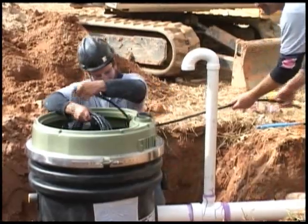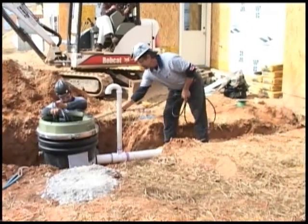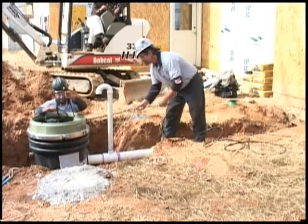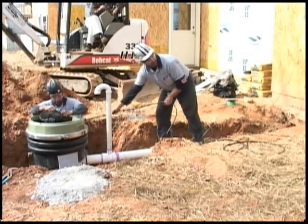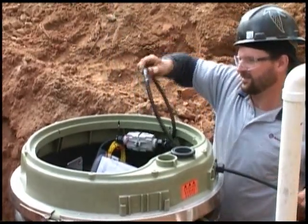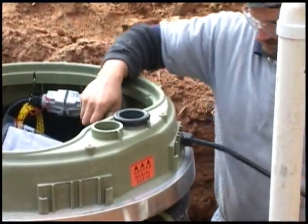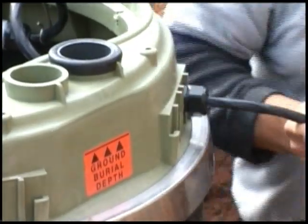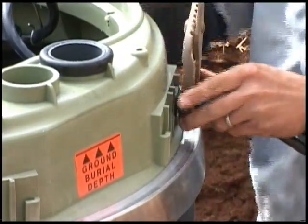The supply cable, a six-conductor tray cable, meets NEC requirements for direct burial, as long as a minimum of 24 inches burial depth is maintained. Those portions of the cable that have less than 24 inches of cover must be contained in suitable conduit. This includes the vertical portion dropping to a 24-inch depth at the station, and the vertical portion of cable rising out of the ground at the control panel. Pull the entire length of cable from the station to the mechanical stop. The gland nut should be tightened down by hand and snugged with a wrench. The cable should be of adequate length to provide a continuous run to the control panel. Pay particular attention when backfilling so that the cable is not cut, crushed, or abraded.